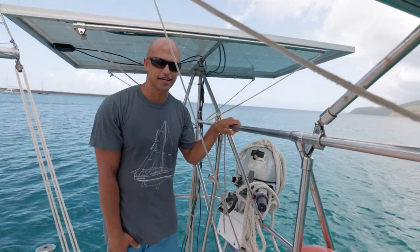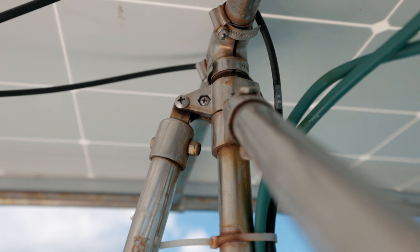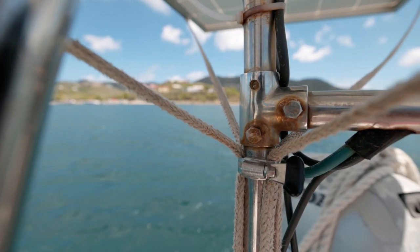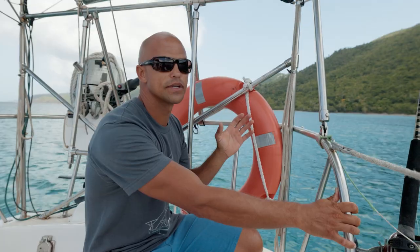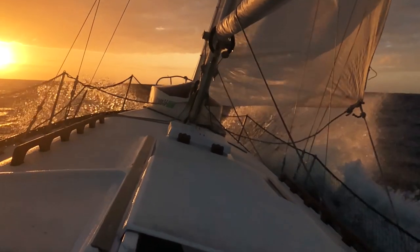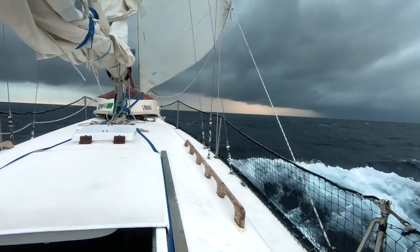The way I constructed this, it's like a monkey bar set — just one-inch stainless steel tubing with a bunch of fittings. Some of them I through-bolted, and I want to do all of them because it's a much better way to secure it than set screws. Since we already had this pulpit, I used it as our base structure and mounted all the support beams so that when we're pitching and rolling in heavy seas, the panels wouldn't shake loose. They're still a little loose, there's some play, but it's still very secure. We've had zero issues sailing up and down the Eastern Caribbean — the biggest waves we've seen were about eight to ten footers with longer periods.